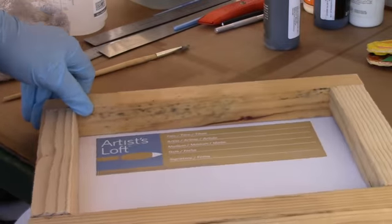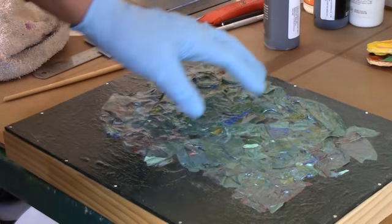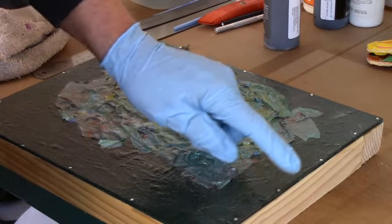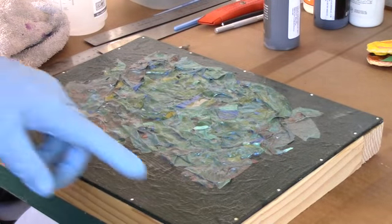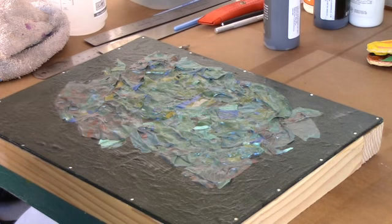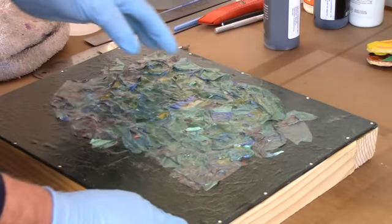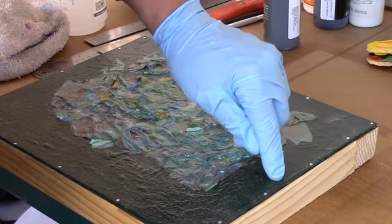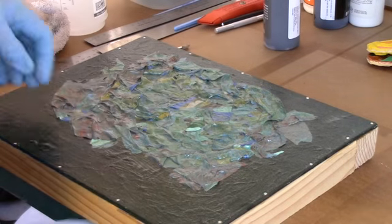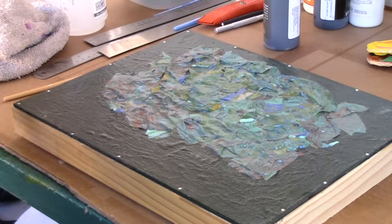And then, when you put the plastic wood on, you want to do the back as well. Come around here to the front, you see there's some little nails in here. Let me move that a little bit. See the little nails here? What I do is, one piece at a time, I'll put some glue on the wood, nail it down with the little brads, do each one of them, and then go from there. Once we get it done, you can go ahead and put the plastic wood just over the nails. Just put a little bit around it, so it makes a frame. And the frame becomes an integral part of the painting, so you don't have to worry about having anything framed or do anything more to it.